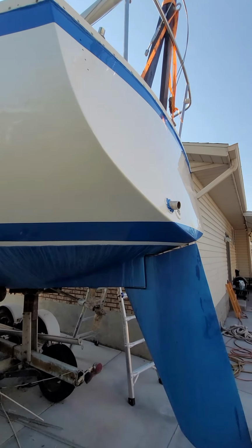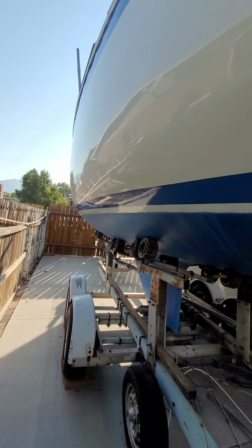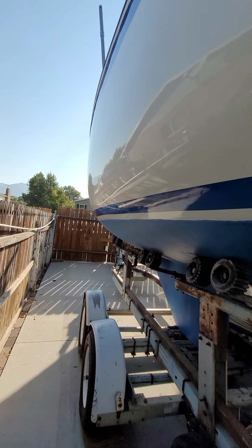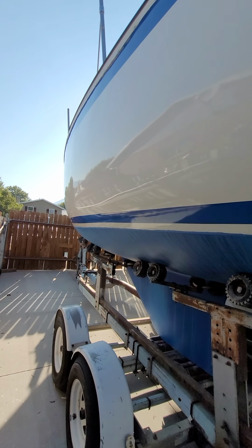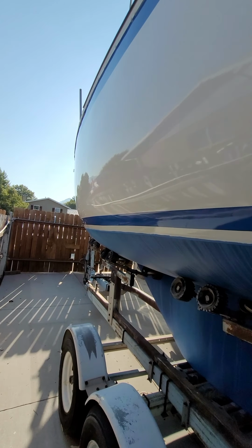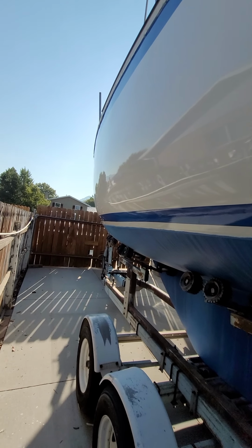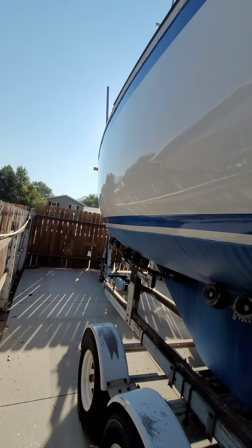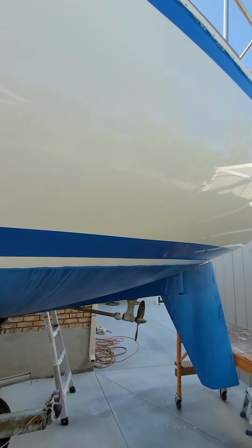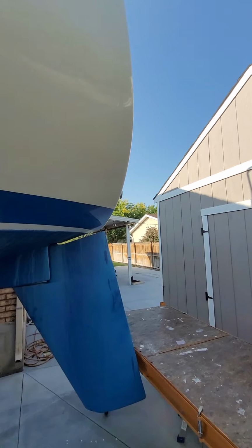They say 10 to 15. I went with Andy's method from Boatworks Today on YouTube. He thins it until he gets a 5 or 6 count after stirring it. And I've got to tell you, that is a great way to do it. And then again, I used the foam rollers that Total Boat sells with the 3-inch badger hair brush to roll and tip. It's a Red Tree.